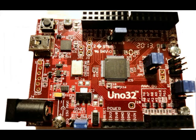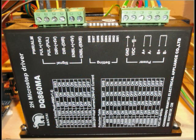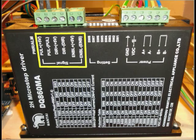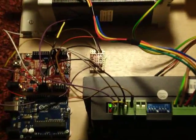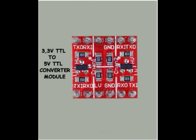This is a 3.3 volt board and has 42 pins for IO. If configured for inputs, ideally it needs to be 3.3 volt, but they will take 5 volt according to the literature; however, your outputs will only be 3.3 volts. So my Chipkit board is driving out pulses at 3.3 volt. These pulses are then sent to the microstep driver, and my microstep driver wants these pulses to be 5 volt.